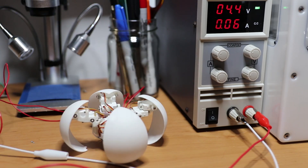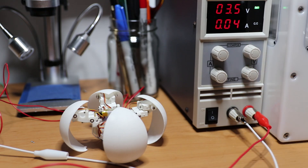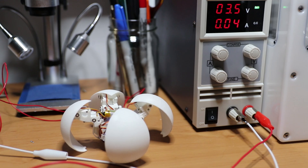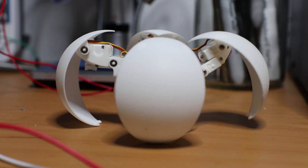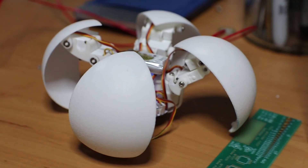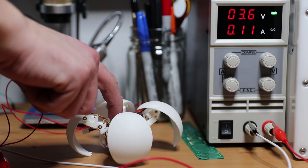I'm going to power the robot with the lowest operating voltage, which in this case is around 3.5 volts, and send the command via Bluetooth to actuate one of the femur linkages and see if it manages to hold the weight on only three legs. After watching the footage, there is a little tilt on the robot, but I think we have to blame the flexible nylon for that because the servos are barely drawing any power. If they were struggling with the torque we would see the current pump right up.